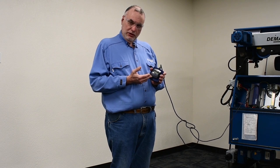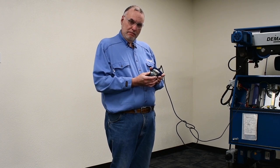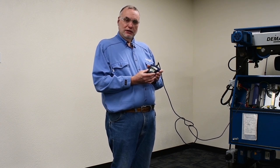A KP500 keypad was provided with every Demag complete crane order when the DR Pro was being sold. If the complete crane wasn't provided, the tool is not present, but if it was a complete crane, the KP500 should be present in the bridge panel or in a brown box tucked in the corner of the bridge panel. Many times they've been removed from the brown box and they're in the face of the bridge VFD. They can be removed and transferred over to the trolley or hoist VFD.